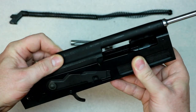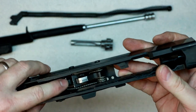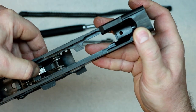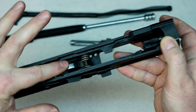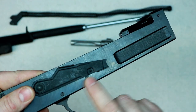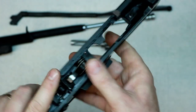It's going to hit on the trigger. Since it's a semi-auto, it doesn't have the safety sear holding it down. The safety sear, the third pinhole, would actually hold it down lower, and this wouldn't ride over it like it does here. That's why they want to hang up in the back, because they sit a little higher, because we can't have the third hole unless you pay an outrageous amount of money, have the proper licensing and stuff like that.